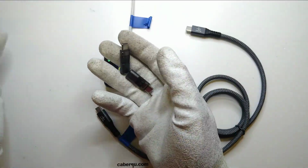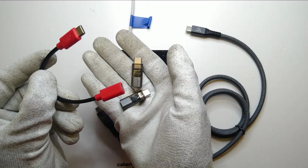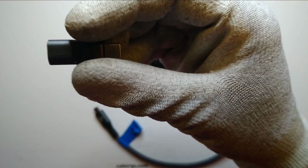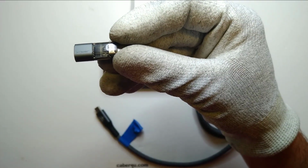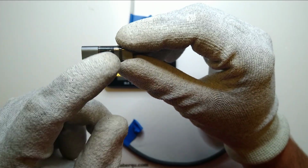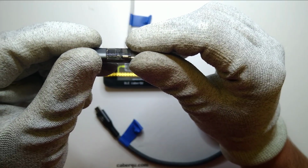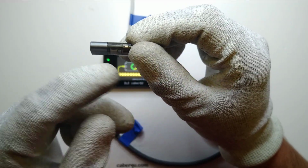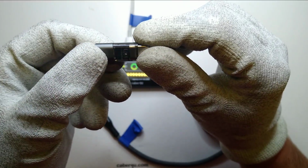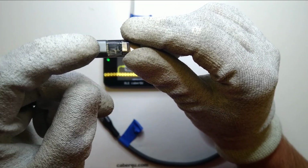So without further ado, those are the so-called data blocking adapters, and they are at their core the same as this cable. They are just shrunken down, so they save this piece of cable in the middle. If you take a close look, let's take a look at one of them and focus on that correctly. Yes, that works. I hope that you can see it as well as I can. You can see that the case they used and the piece of plastic that they actually molded in there with a little PCB is, I think, normally used as a power indicator adapter. So there just is a big blank space with a PCB that just has one or two components on it, one capacitor per side to stabilize the voltages, and the rest is empty.